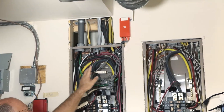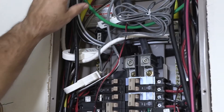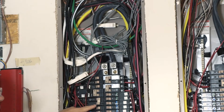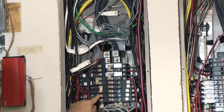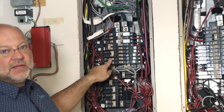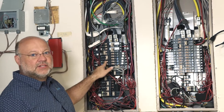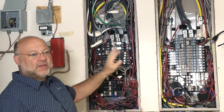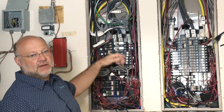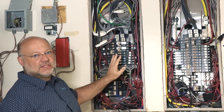The Sense system has CTs that go over the solar PV and a couple that go over the main lugs for the service panel. It has a feature where when an appliance comes on in a circuit, it sees the electrical signature of the motor and estimates what that appliance might be. So if you turn a dishwasher on, it sees the pattern of that electrical consumption and says that might be a dishwasher. You confirm it, and from there forward that dishwasher is recognized — though I haven't found that it monitors all of my appliances correctly.